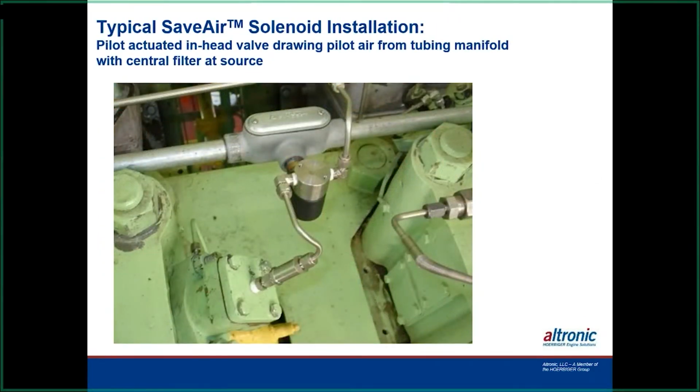Another picture of how we got the solenoid set up. Again, like I said earlier, we really recommend keeping that tubing as short as possible because this thing is cycling back and forth. It's charging this cylinder area, piston area here, and then it's got to bleed it all back out again through this orifice and then do it again every revolution to keep the cylinders rolling.